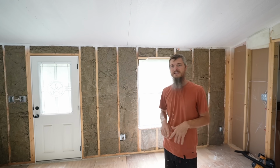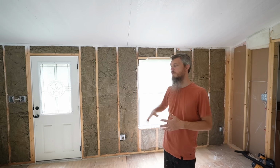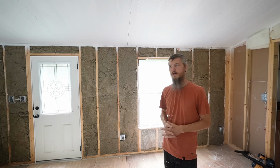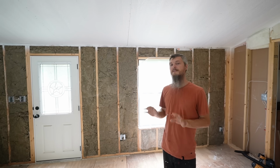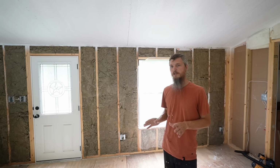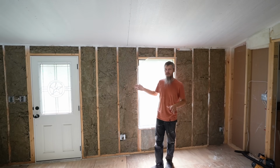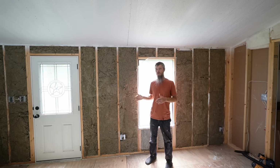mobile home. We're doing that because it's just quicker and easier than drywall. It's sturdy and gives strength to these walls, and it doesn't decay and crumble when it gets wet. We're not fans of drywall. And an old mobile home like this is prone to moving. It probably will shift around over time. Drywall is more prone to cracking, and the Smart Side panels are going to be a lot better in a mobile home because they're never going to show cracks.